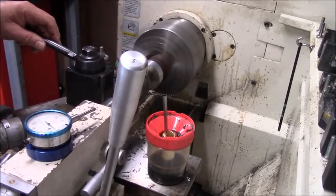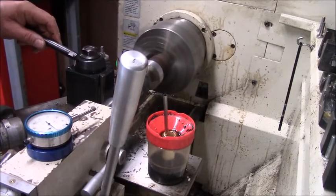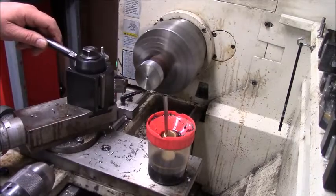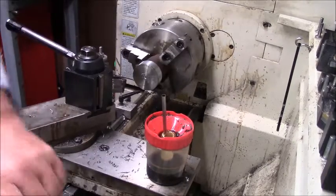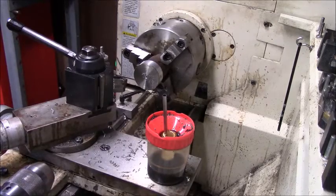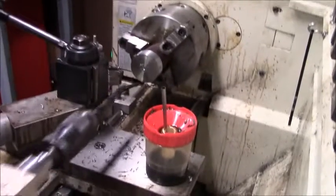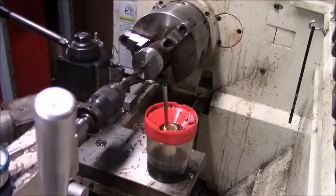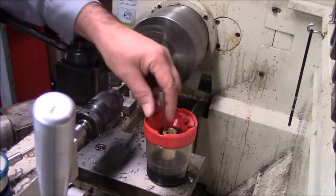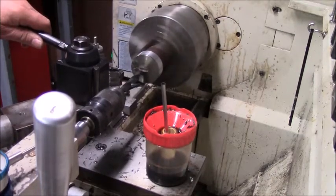That's where these longer handles come in, and I know I've had some comments on videos in the past about the danger of the longer handle. Well, it's not that you torque on it. You had to tighten the short ones so much to keep them from moving, especially on larger drills, that it's a real PITA. So let's just kind of work from there. We've got her down to about 320. We're going to go in about 3/4 of an inch here with the drill. This is a 1/2 inch drill, by the way.